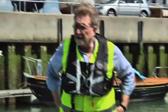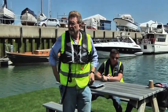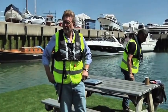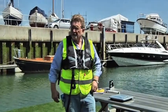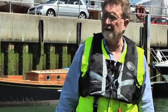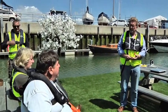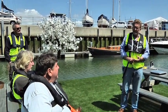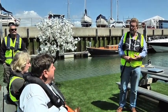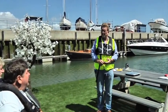So the next bit, practical heel test, as distinct from an inclining experiment, what we're doing is measuring how far a boat heels over with a certain number of bodies all down one side. The bodies are, properly speaking, according to the code, supposed to be taken at 75 kilos per person, except that if you know you're doing a boat that's taking people who are clearly going to weigh much more, there is a Health and Safety Executive document called Heavy Persons in Lifeboats, which doesn't necessarily apply to this, and there's various other published documents about the weights of people on boats.